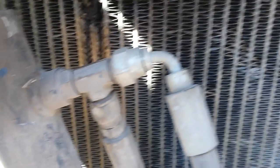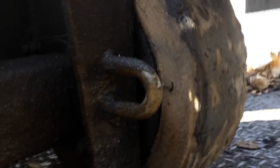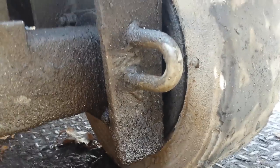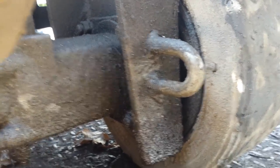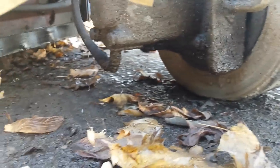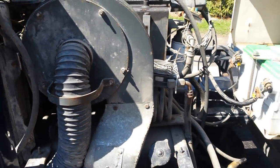I'm hoping they can solder the radiator ends shut — just cut each end and solder it shut. I've seen that done. I'm not that great at soldering so I'd rather just pay someone to get it done. There's the drive wheel from this side — it's got a huge hydraulic motor there. I welded that U-bolt on because this thing gets stuck just looking at it, so that bolt is just a hook: chain on and pull it out when it gets stuck. There's almost nowhere to tie onto this machine.